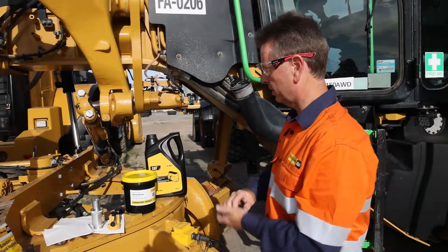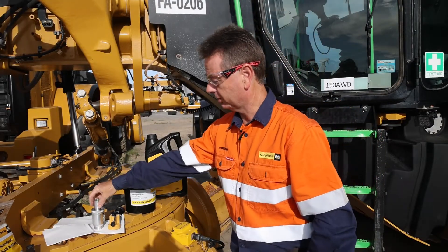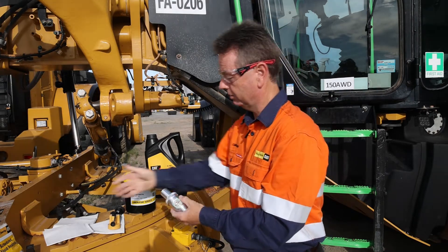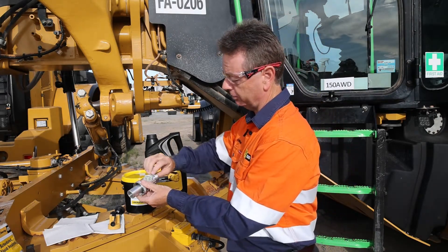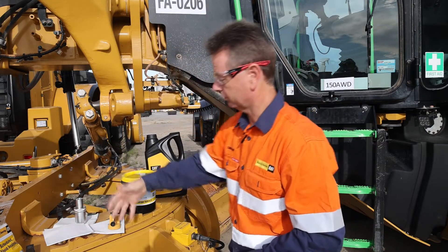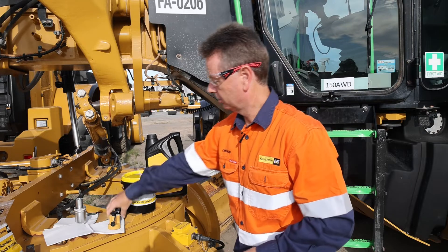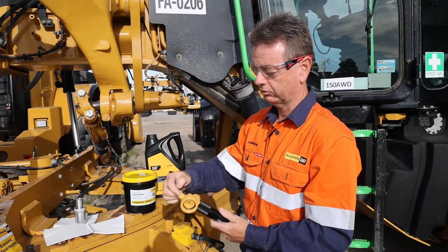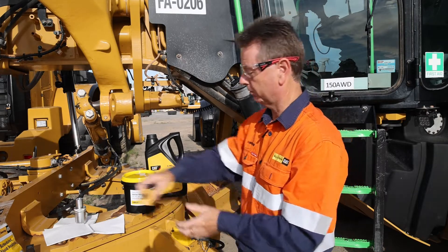Some key considerations for taking a sample are primarily keeping everything clean. As you can see, we have our SOS 17 adapter — this will be sprayed with some parts cleaner to clean around the thread and around the attachment here to make sure it's clean. Please then store it on something like a clean rag. The actual sampling apparatus — again we spray in here, we also spray in there just to make sure it's clean, and wipe it down.